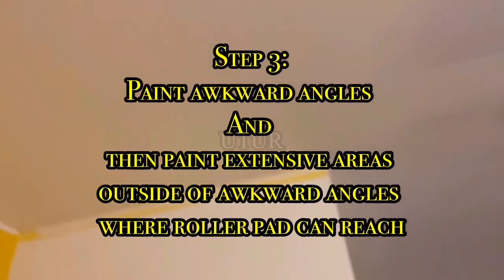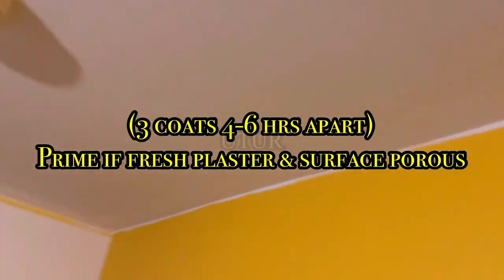Sometimes it doesn't mean you've got the wrong paint — it could just be all those variables mentioned earlier. I have done masking around the perimeter of all the walls in the living room. Whilst painting the obliterating emulsion on the ceiling, the sensitive tape on the sidewall helps prevent it latching or spilling onto the brilliant white. That's because as opposed to just touching up white areas, I will be painting all of the ceiling with the obliterating emulsion — the exact paint didn't match for some of the reasons aforementioned.